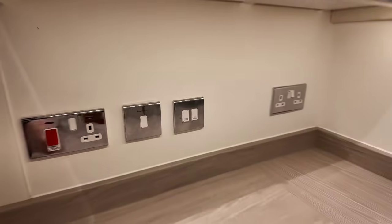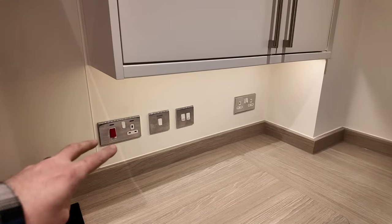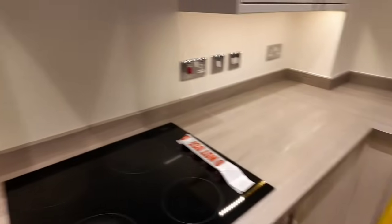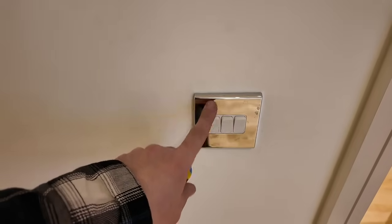If possible, unplug appliances — that would be best. However, in this example there are built-in appliances fitted into the cupboards so unplugging isn't an option. Other sensitive things are sometimes lights and dimmers. Above these lights there may be transformers, and you might have to switch those off because you just can't test through them. Similarly, a dimmer switch with a dimmer module will drag down the readings.